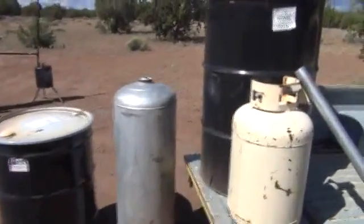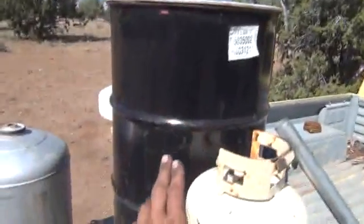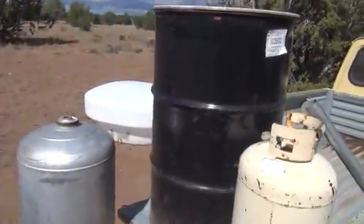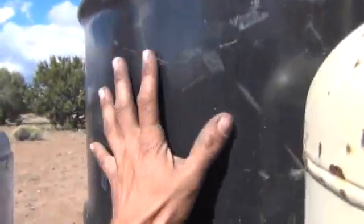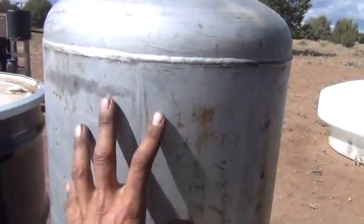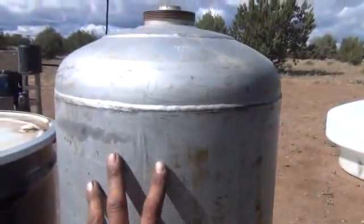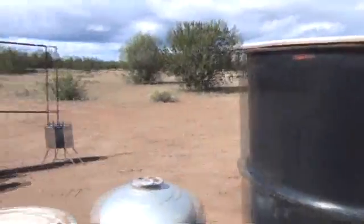So that's where we're starting. That tank welded onto the bottom of the other one, once it's done, will sit inside one of our barrels here — about halfway down. The bottom of the reactor will sit about halfway into this barrel. That's going to give us a dead air space that the heat can travel around, preheating our material inside of it — especially important driving down the road where wind carries away a lot of our thermal energy. So it'll be insulation in parts and air channels in parts, so the smoke can get to the top and out through the rest of our system.